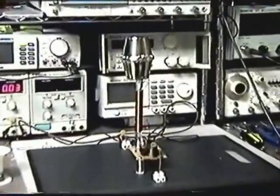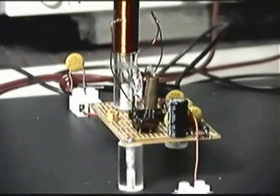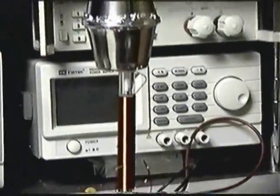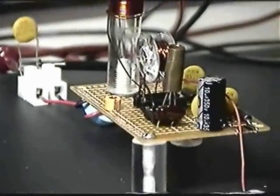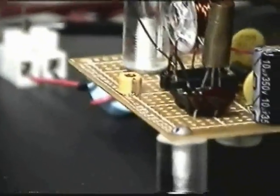Here's the new transmitter. It's using the new SEC-exciter design that's tuned with a small variable capacitor — no longer do we have coil L1. Here's the wire that goes out to the receiver. There's a little yellow trimming cap that does the tuning. There's one tuning spot only on here — it's either working or it's not working — so it's very effective. We don't have the multiple modes that we had before.